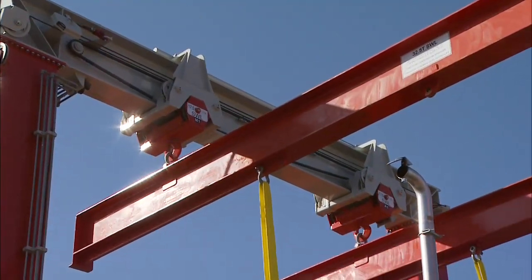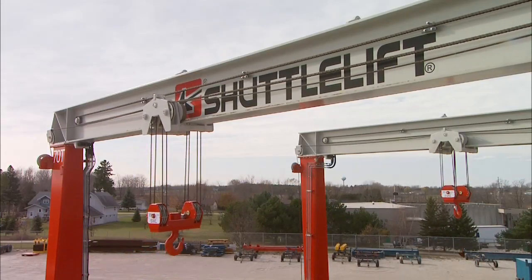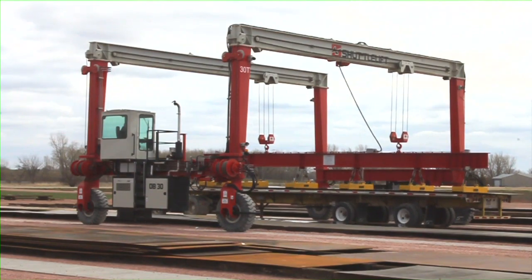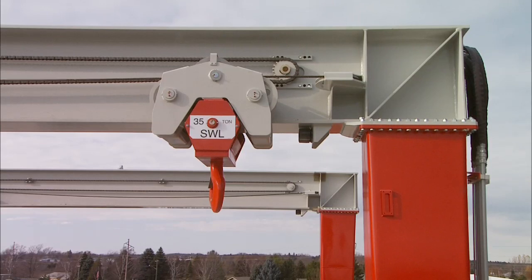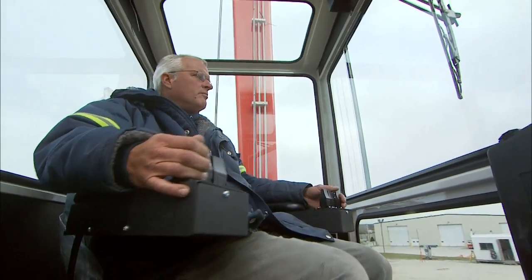The trolley traverse is hydraulically driven and can traverse empty or loaded without actuation of the hoist function. The hoist is also hydraulically driven. The hoist system has both counterbalance in the hydraulics as well as a spring-applied, hydraulic-released brake. When the lower block two-blocks with the trolley, the hydraulic system goes over relief, protecting the components from damage.